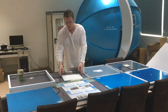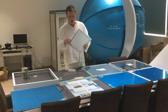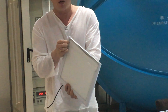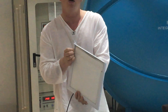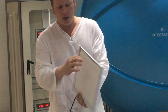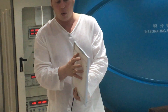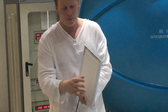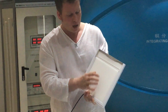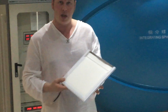We use that on a demo that we show to some customers, which is a cross-section of a small panel. As you can see, we've got a full-formed aluminium back there. You can see how we're using a 5630 diode — the original one. We're using 5730 Epistar LM80-approved diodes on our current manufacture. This panel is actually a 4mm light guide plate imported from Taiwan — very high-quality, won't discolor. And at the front, we use a self-extinguishing PC front cover for diffusion.